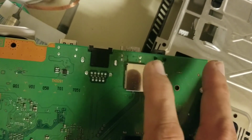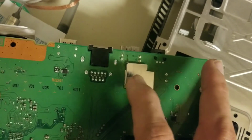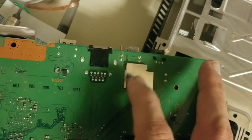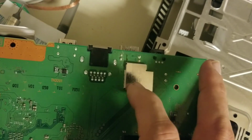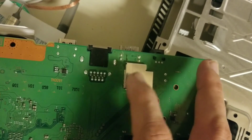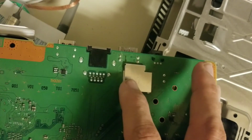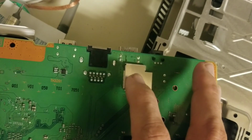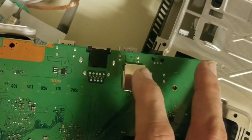I do think I have another video up, pretty sure at least on YouTube, I'm not sure if I have it on my Facebook, of at least the filters being a problem. And I do have a soldering video, I'm pretty sure, also of my replacing the actual HDMI encoder, which is a really big pain. I think it's like 110 point solder. You definitely need some blown air or a rework station to do that one.